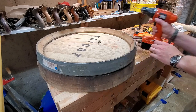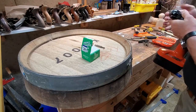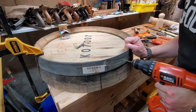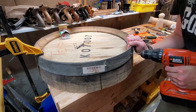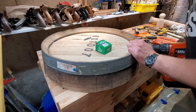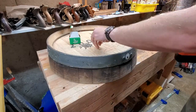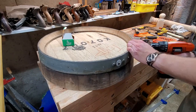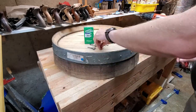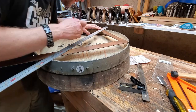Now I'm going to work on the barrel top. Because we cut the barrel apart, there's no longer tension on the staves keeping the hoops in place, so over time they would wiggle loose and eventually the hoop would pop off and it would all come apart. I've seen some barrel top tables where they've removed the hoop — it looks a lot slicker — but I was looking for something that looked kind of dive-bar rustic, so this worked out. I'm going around with my drill, drilling a hole through each stave and the hoop, then driving a metal screw through the hoop into the stave. That made everything a lot tighter and much less wobbly.